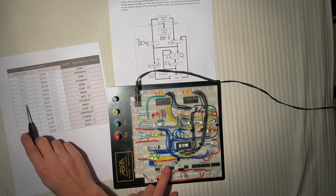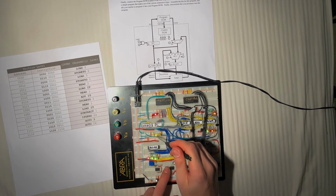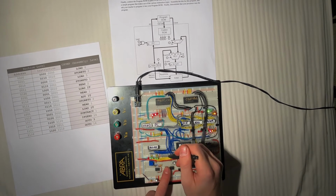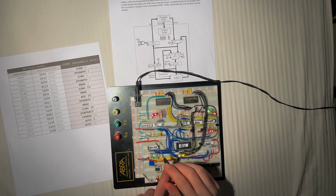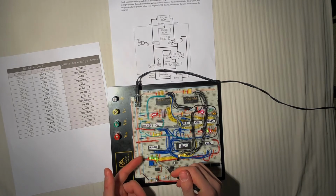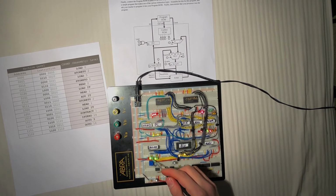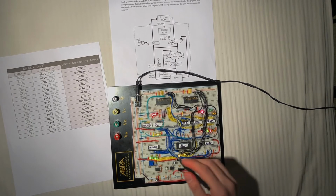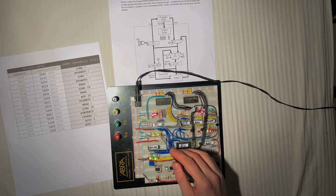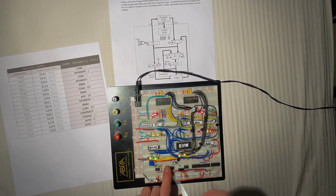As well, in this line is a read 2 command, so we read that too. We're going to load what's in address 2. It's currently a 0. We're going to read what's in address 1. And we're going to add them. So 0 plus a 5 should equal a 5, shown here. This is least significant to most significant bit, the opposite of the normal way you'd look at it.